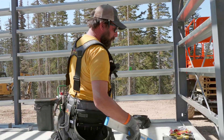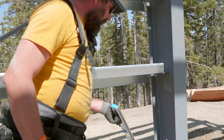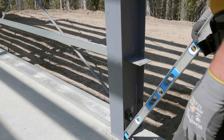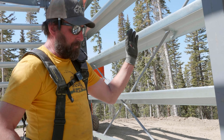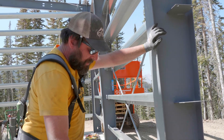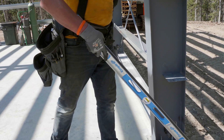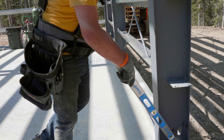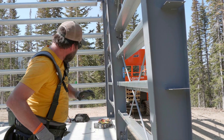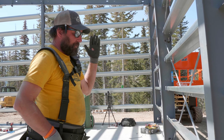In order to move this, the base plates are fairly snug. Since we want the column to come this way, we're going to loosen these two bolts on this side. We're going to try to only loosen the inside of the right side. It's like a half-inch or five-eighths-inch base plate, and if these bolts are snug, even though it's off center, it's going to hold that plate down. Because I like where it is in and out, I'm going to try to leave that one on there — maybe just take a little tension off — but I know for sure I need to loosen these three, and probably those too. We're going to do that on all four columns as we bring it over, so we're not binding or bending the steel to get it to come plumb.